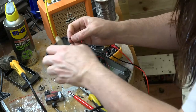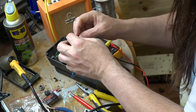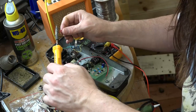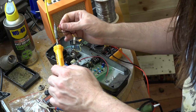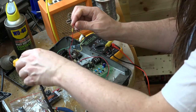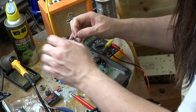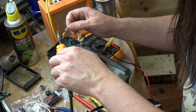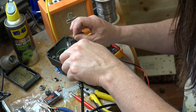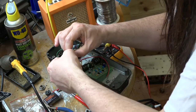Just snip off a bit of the excess because you don't need all of that, and then if you fold it you can put your heat shrink over the top and heat it up with your iron. What we used to use at work for heat shrink was one of those wallpaper stripping guns, but that's a bit of a sledgehammer to crack a nut. In an energy crisis, the edge of your soldering iron is more than adequate. I've got a bit of solder on there — you might get a bit of solder residue — but that'll do, that's solid enough.